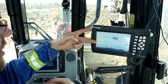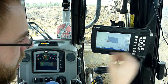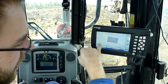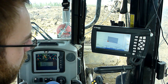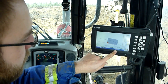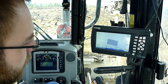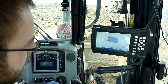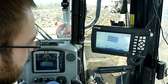The other thing you saw is all of a sudden now I have two lines. The black one is always design and the red one is what I have my offset to. So we're actually doing an undercut here — it's a one-meter undercut. You'll notice that my blade will touch the ground once I reach one meter. One meter and I'm on the ground. And that's back to design right there. I actually can't reach that high, so I'll bring it down so it stops.